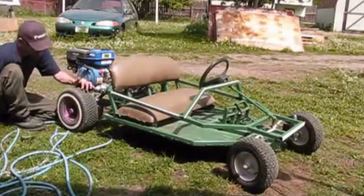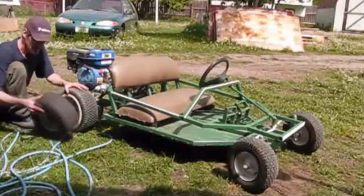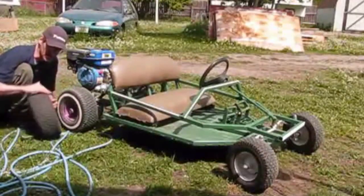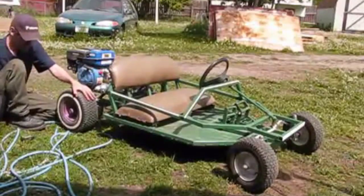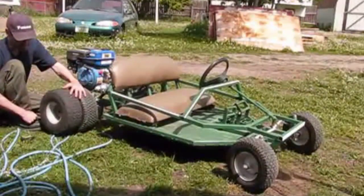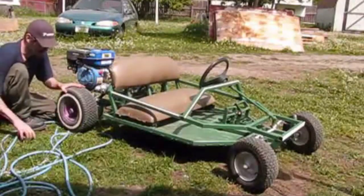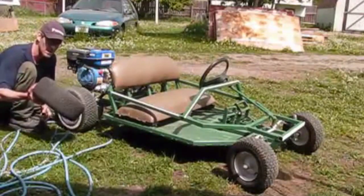So in the event that I ever pop this tire or whatever, I know that I can go down virtually any place and get new tread. Well, this doesn't have an inner tube in it, but I have to get an inner tube and a tread. So, if this rubber ever gets screwed up, I got real easy replacements. That's why I like these 15-inch tires, because they're easier to replace. I don't have to get online and try to order them from someplace or anything like that. This size of tire is real common for a front tire of a riding lawnmower.